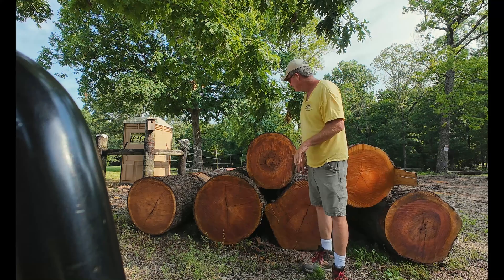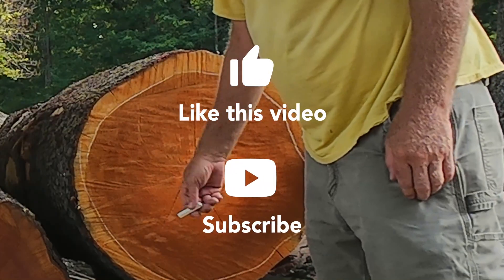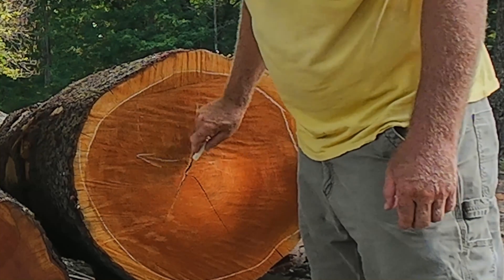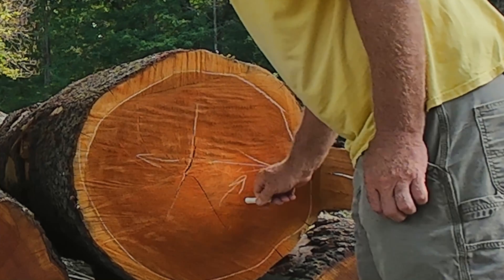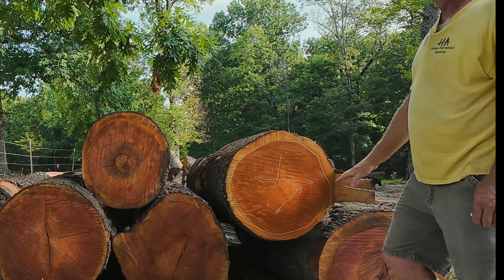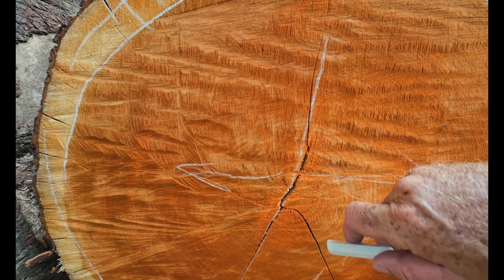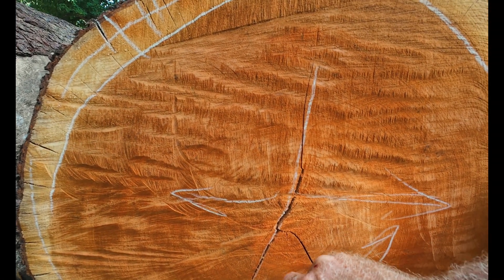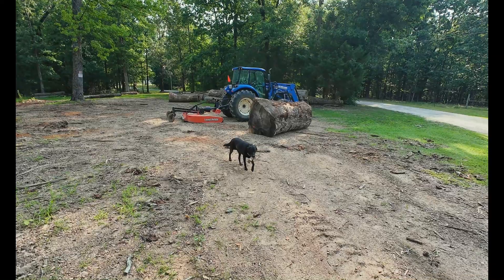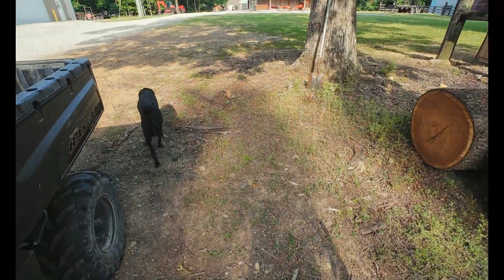Now let's look at some of these guys and analyze them. Let's pick the pretty one first. Big sap ring — that's coming off. Not much stress in one plane. It's got stress going this direction, this direction, and a little bit going that direction. As I'm sawing this, I'm identifying where the major stress is going to be. This one's going to be a pretty easy log to saw. You can start to see the change in structure, so all the boards will be coming out of this outer area. Chip's already been into the burn pile — he's found me a piece of wood to bring back. Good dog. He's breathing hard.